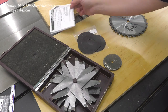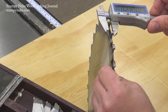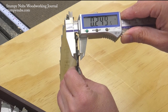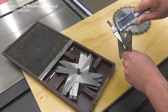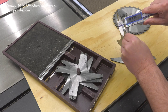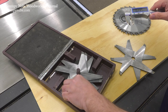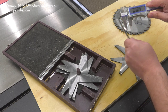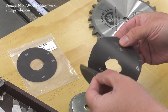While I have a caliper handy, let's talk about that chart again — if you don't have one, you can make one. Start by measuring the precise thickness of the teeth when your two outer blades are nested together; that's the minimum dado width you can cut and it's the baseline for all dado measurements. Now measure the chippers, but just the flat plates — not the teeth — because the teeth are designed to overlap the blade or chipper next to it, while it's the plate that adds to the overall thickness of your stack. Many sets come with 1/8 and 1/16 inch chippers; good sets will also include a 1/32 inch chipper. If yours aren't exactly those sizes, make a note on your chart. You may even scratch labels on the chippers so you can easily tell them apart. Hopefully your shims have labels, but if not, measure and label them with a Sharpie.